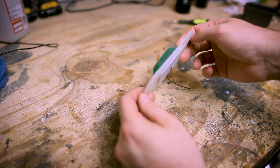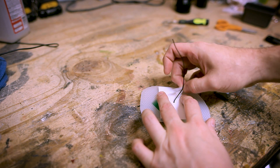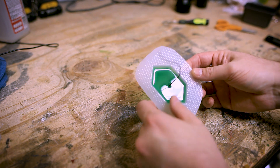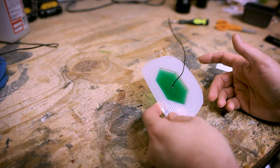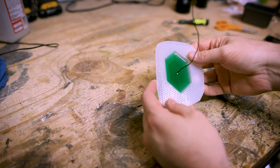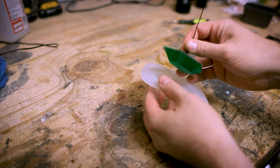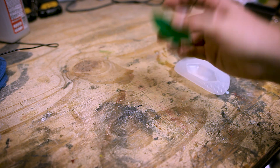The gemstone has now solidified in the mold. I'm going to pull this piece of tape off, then pull the piece of plastic off like this. And as you can see, our gemstone is bubble-free — there's nothing going on on the top. Sometimes you'll get little tiny bubbles trapped at the top of your mold, and one thing you can do is take a blowtorch or a crème brûlée torch and just go over it — it'll pop all those surface bubbles. Because this is a polypropylene mold, we just flex it a little bit, give a little push — you can hear the cracks as it comes free — and just like that, you have a gemstone. You can polish this up and whatnot, but this is our thing right here.